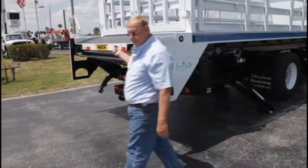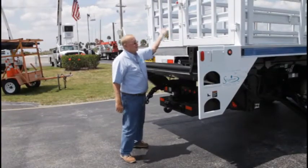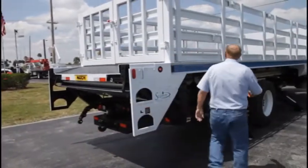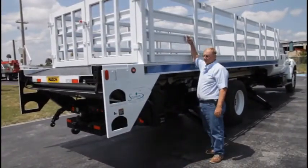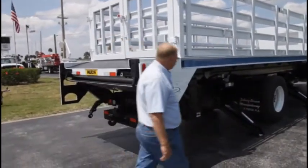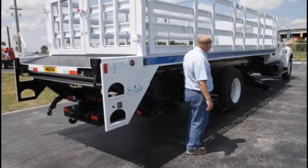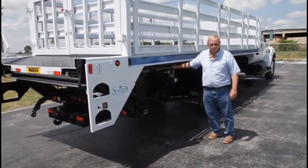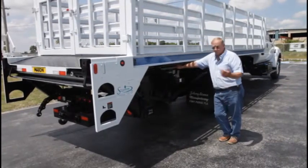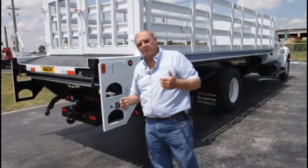We're going to show you a couple other items. Your spring-loaded catches for the gates, they swing all the way around and they hitch right here. I'm going to fold the outriggers back up. I sometimes get fancy and do them both at the same time when you're raising them because you don't have to level anything. Just call them home. We're going to go to the other side and we're going to fold everything up, put the truck back in a driving condition.